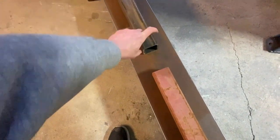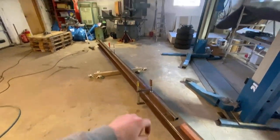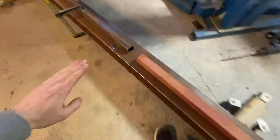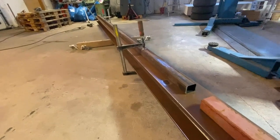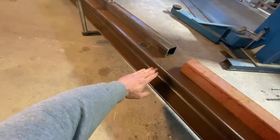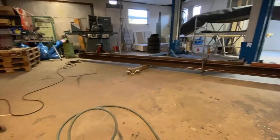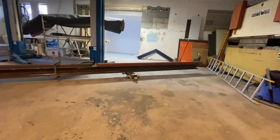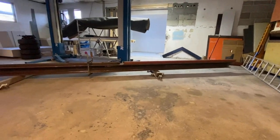How to explain this — this is a 60x60 millimeter square tube with thick walls. These are going to weld on top there, because I want to have this huge steel bracket 60 millimeters down from those wood pieces. So the new roof is coming here, on top and against this one with a one and a half centimeter gap — a shadow gap. This is why I'm going to weld on this one now. Because if I don't put this one on and put it straight to the wood, then the new roof is going to be inside here and it's going to be difficult to make a nice finish. So the result will be much better with this one between. When I weld on the top now, because of the heat, this huge steel bracket is going to go like a banana — it's going to raise a little bit. So I put the spacer quite a lot to the center, so it is already a little bent when I weld, and hopefully it's going to be pretty straight when I'm done.